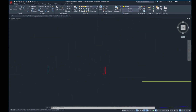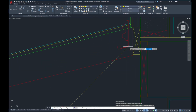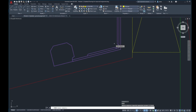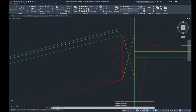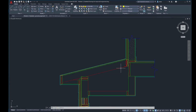Because what we are going to do is hang them in with this joist hanger. So that's a metal, just like a... I've been calling this a joist hanger. In this case it's a rafter hanger, but it is similar to a joist hanger. Oops, I can't get this in the correct place. So I'm going to move that down until it hits the bottom of my joist. There we go. So this is just like a joist hanger, except in this case it's a rafter hanger, and you can bend this bottom portion for pretty much any angle that you need to hang these rafters.